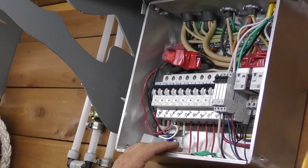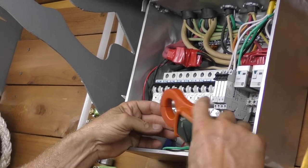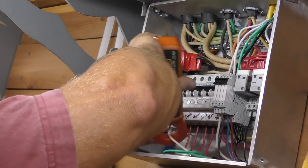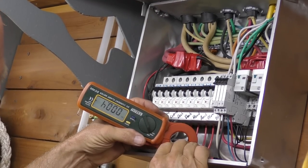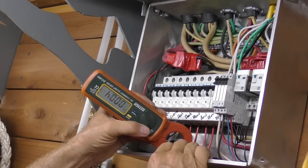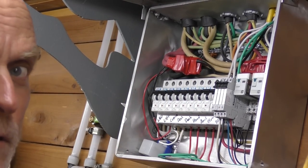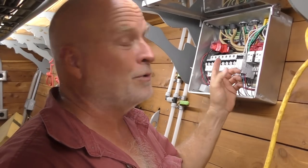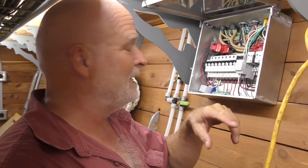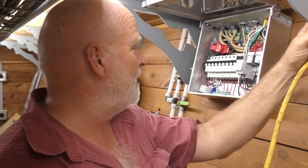And my question here is my crane. It has a remote control on it that's on all the time. It's pulling 0.4 amps, maybe 0.5. No, it's settled in at 0.4, but let's call it 0.5 because the math is easier. We know it's 12 volts and 0.5 amps, that's 6 watts that it's pulling. And it's doing that 24/7 around the clock. So I think I'm going to add a switch to turn off the crane's power.